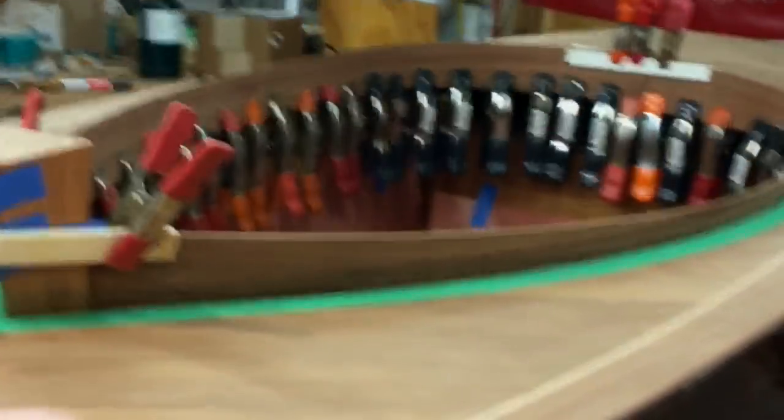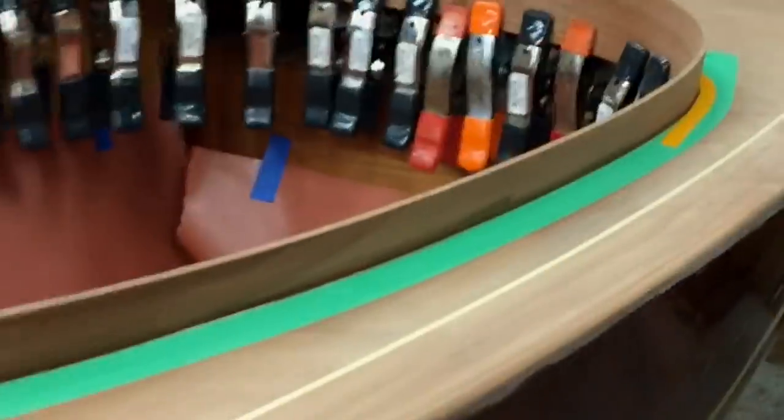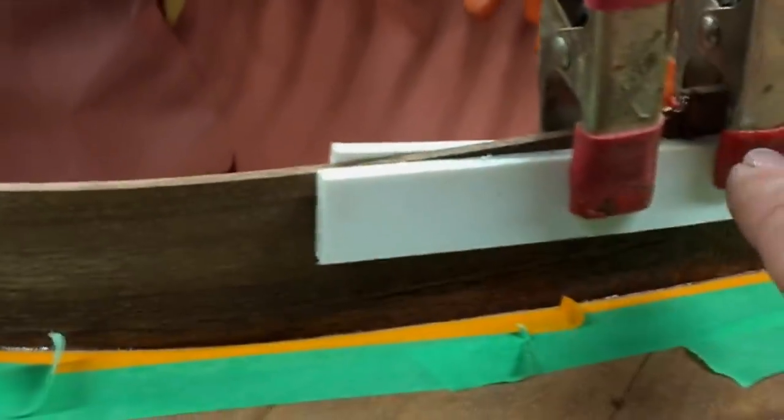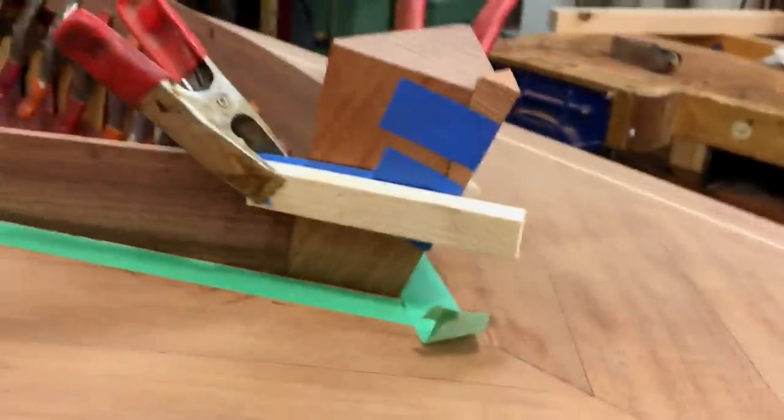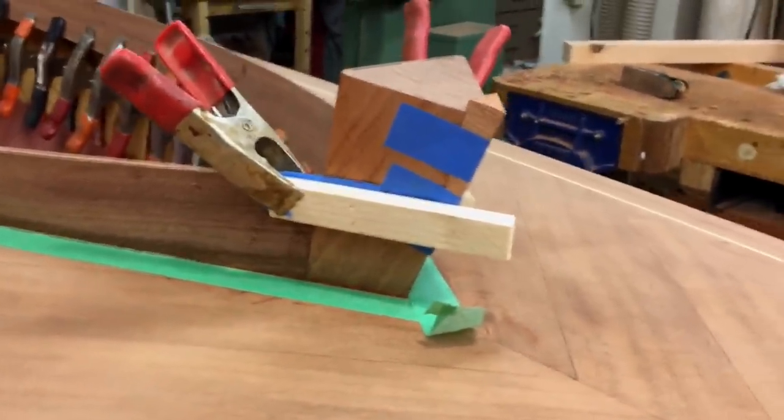I need to trim the top of the combing — the height right now is just rough. It's my finished height roughly at the bow, and then as we wrap around it'll probably stay low through the midships area, and back here it'll come down just a hair higher than midships just for looks. There's my little heel graft in there just like a little dovetail key that locks it all together. Just a little pin nail through this cleat to hold it in place, making sure we have proper alignment between that cleat and the outside of this little block. If there's anybody out there who knows what to call this little bit of blocking, please let me know — in all the years I've been building boats I've never heard it referred to by anything specific. I suppose it's like a combing stem.